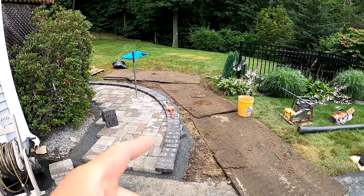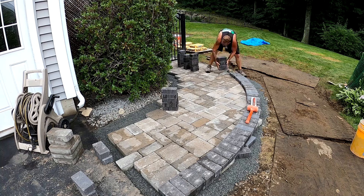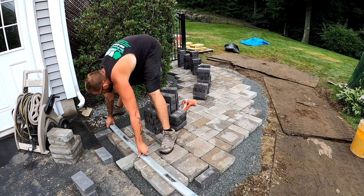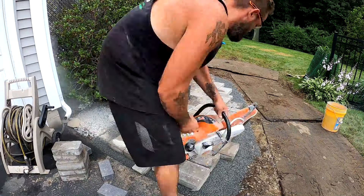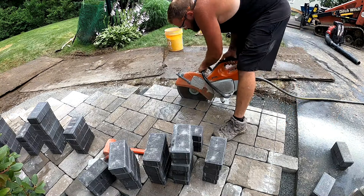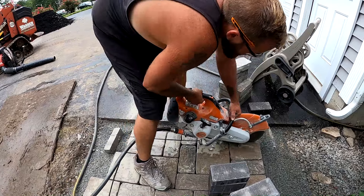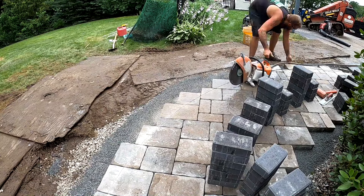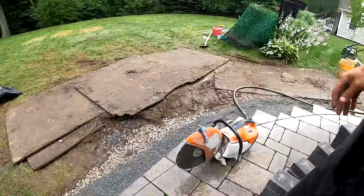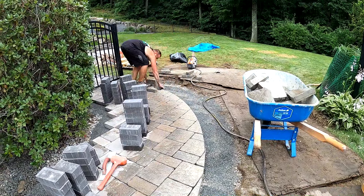In my mind, laying the border pavers out dry is the best way to lay out a radius and mark pavers for cutting. If you don't lay out your border pavers first, you're really just guessing what the radius is going to look like. I scored the line first before doing full cuts — that gives me a nice guideline along the whole edge to follow. When you have this many pavers to cut at once, make sure you use water, because it helps with the longevity of the blade and prevents silica dust from getting into your lungs.